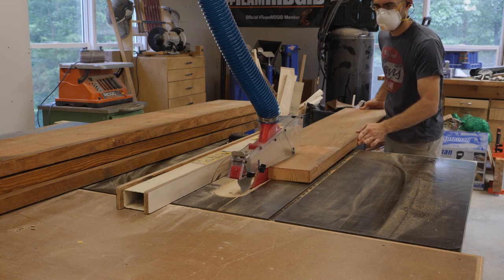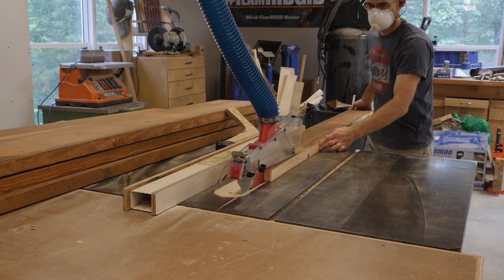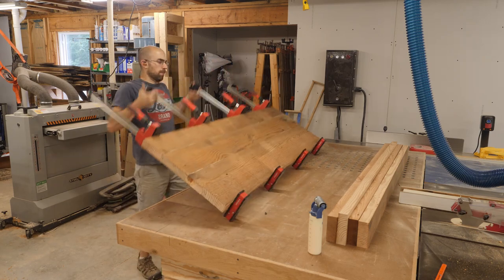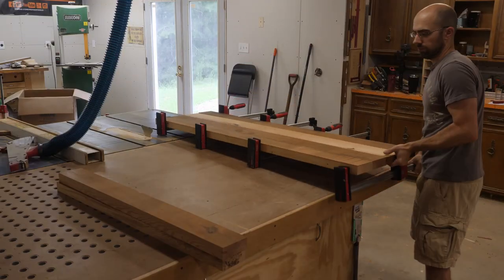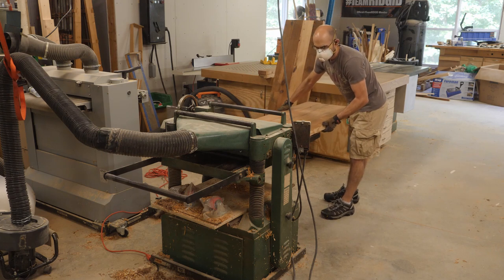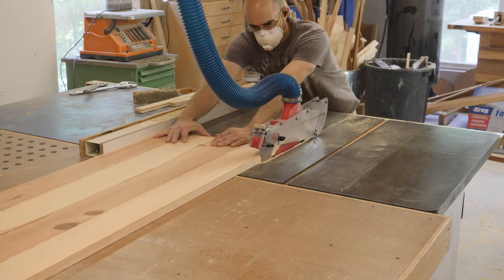This particular board has cupped considerably. Notice the board is on the saw so it will rock — this is intentional so that the board falls away from the blade once the cut is complete. With a second cut on this board I finish removing the pith. Before gluing up this panel I joint one face and both edges to ensure a flat glue-up. Before running the panels through the planer I scrape off the excess glue, and after several passes the panels are finished. At this point the panels are ready to be ripped to their final width on the table saw using a glue line rip blade.